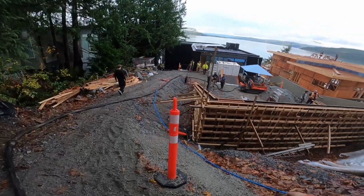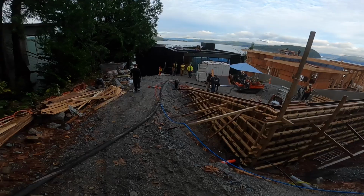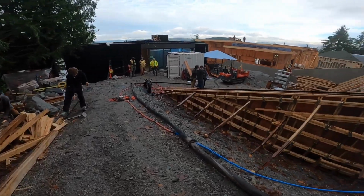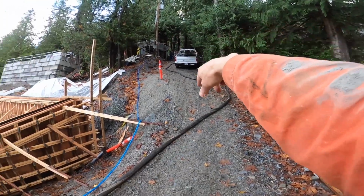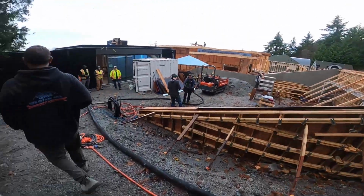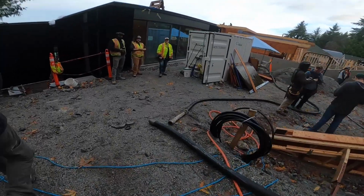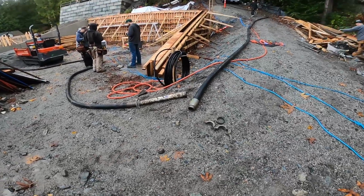and we're pouring about 20 yards today for this tall retaining wall and a little step over on the other side. So we've run 2.5 inch hose all the way to the bottom of the hill here, tied off once again right there. So we've tied off 1, 2, 3, and then we'll tie off in a 4th spot near the back of the pump. Today's instructional video, how to prime the pump without plugging. So if we plug, we're gonna look really stupid, but we're not going to.